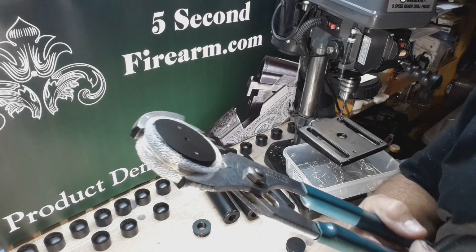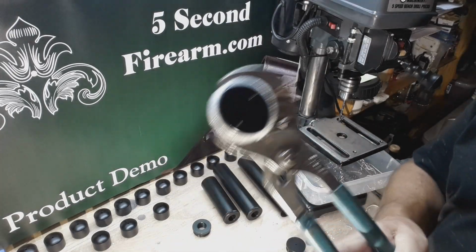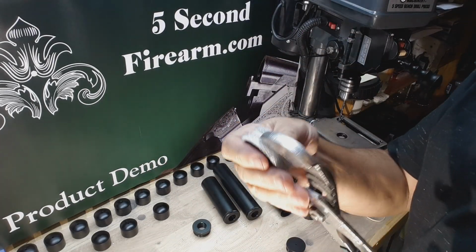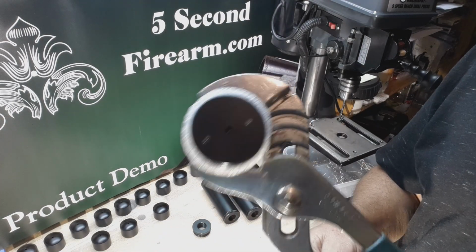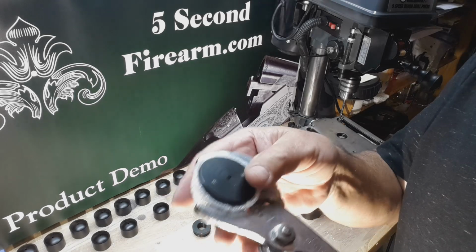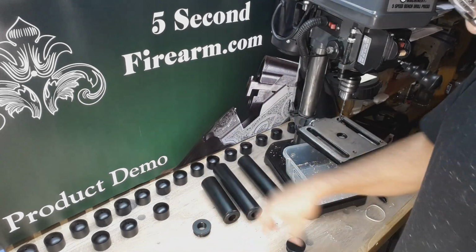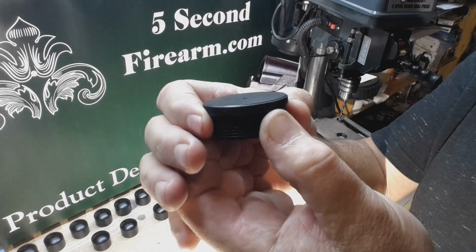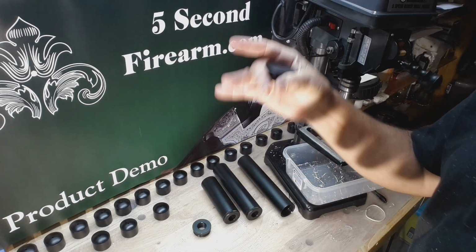Okay, you say, how do I drill a hole through my end cap so that I can put a drain in? Well, this is one little gadget, very simply, that I like to use. There's lots of ways to do it. Some folks create a jig out of a wood 2x4, slice it down the center, put a hole in it that the end cap actually fits in up to this part, where the top rests in it, and then put a bolt through it and it clamps on it so that they can put it into the jig.